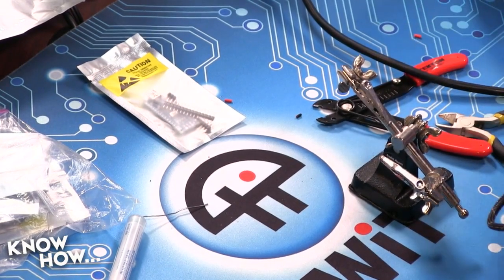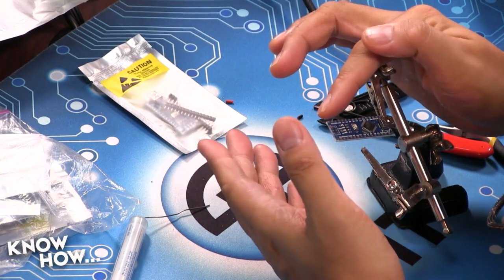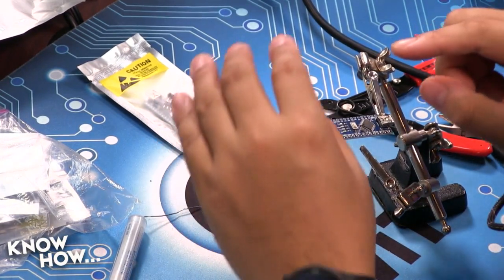All right. Now, when we hook up the Arduino, we are going to need a couple of things here. We need to give the Arduino 5 volts. I can either give that through the USB port, or I could give it through the voltage in pins, which are right here. So up top, I've got voltage in and ground. I also need 2 wires to go from the Arduino to my lights. One is ground and one is the digital pin, the one that's actually going to be pushing the data down the line. Because we're kind of pressed on time, we're going to power the lights with this, because this is the one that's going to give us enough power, and then we're going to power the Arduino with the USB. Cool.